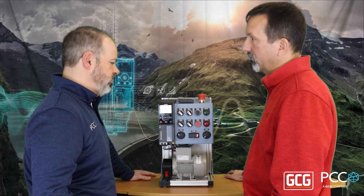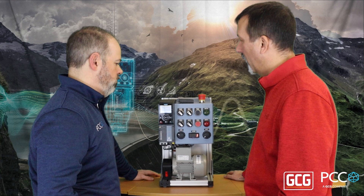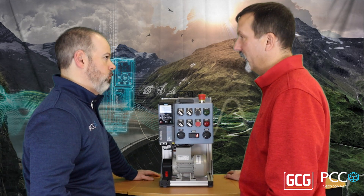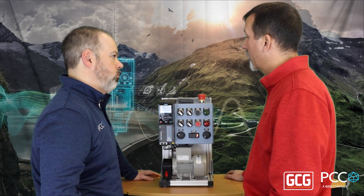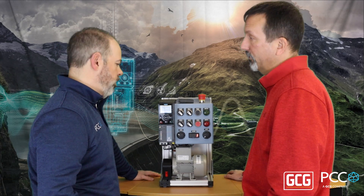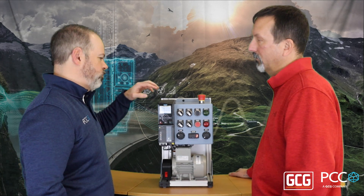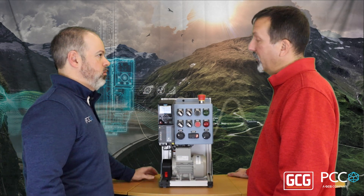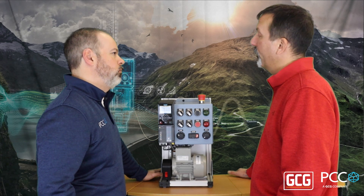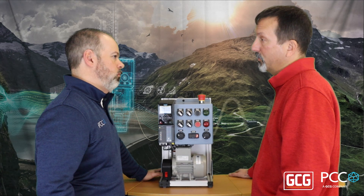So industrial pumps and fans — what kind of functionalities are we looking at here? What's great about this thing is it really lends itself well to pumps and fans. There are built-in functions for deragging. There's fire mode, which you'd use on a fan so that it continues to run until it can't run anymore. So safe to assume it's a pretty dumb drive with respect to control — everything comes from my PLC and the PLC just gives it a speed reference? You would think so, but you don't have to connect it to a PLC at all. There are free function blocks you can access inside.